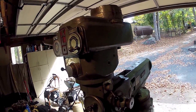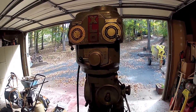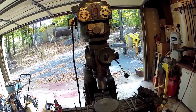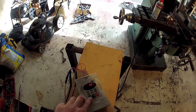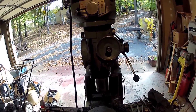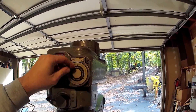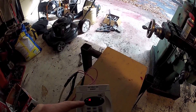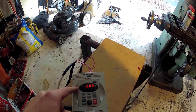I already mentioned starting the motor, but running the motor a little bit faster also keeps your current draw down. I'm reluctant to run the motor too fast because of its age, so I reprogrammed it for my needs. I thought that a 10-second motor spool-up and a 30-second coast-down was a bit excessive, so I changed those to 6 seconds. When you push run, the spindle starts and reaches maximum speed in about 6 seconds. This machine still retains its mechanical pulley-to-pulley variation for speed. The 1740 RPM motor is turning at 60 cycles per second, and you can display either frequency or RPMs of the motor itself.